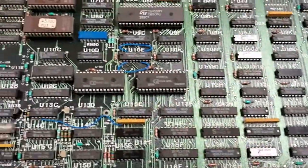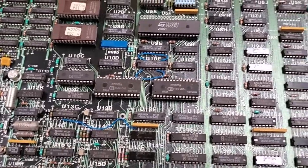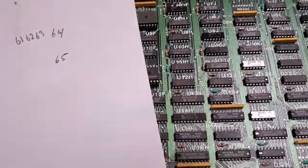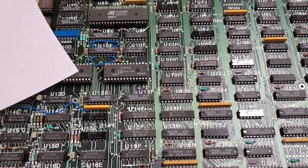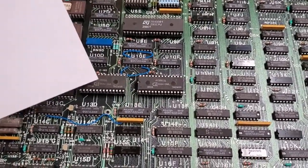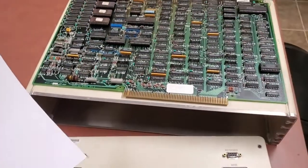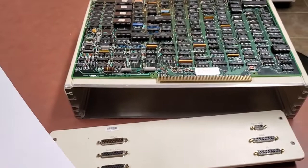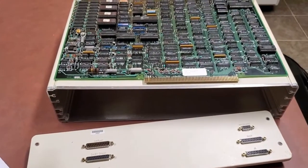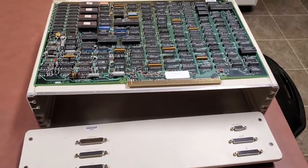I did look up these chips — I believe these are serial chips. My plan right now is to put power on the bus and hook the oscilloscope to the pins I believe to be serial output and see if I get anything. If so, I can trace it back to these connectors, maybe hook it into the computer and run PuTTY or something, and see if anything gets displayed on the screen. Maybe that'll give us an idea of what this is.